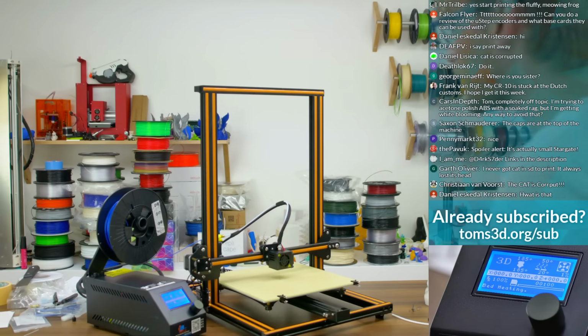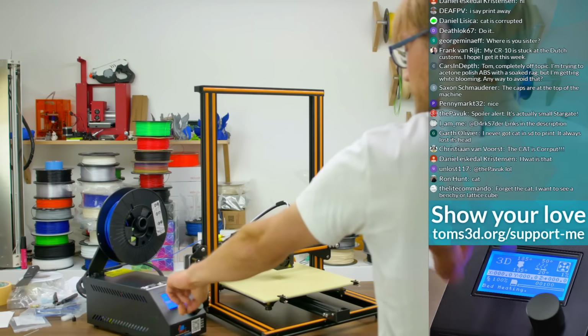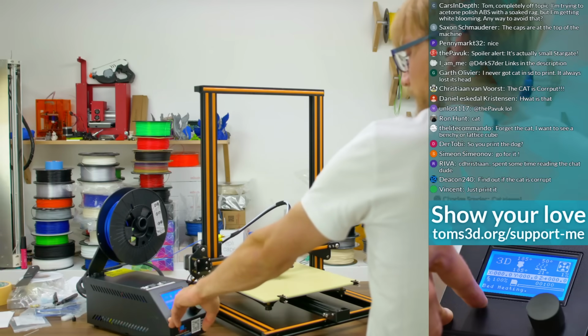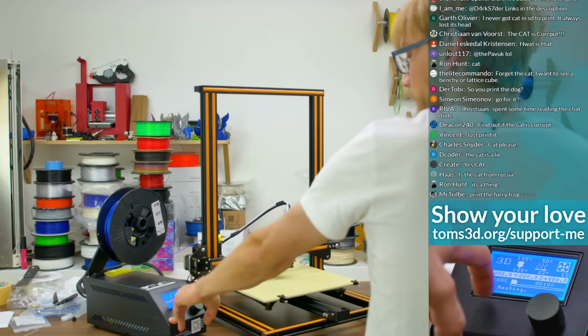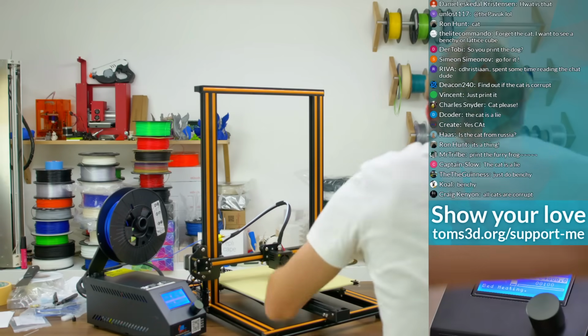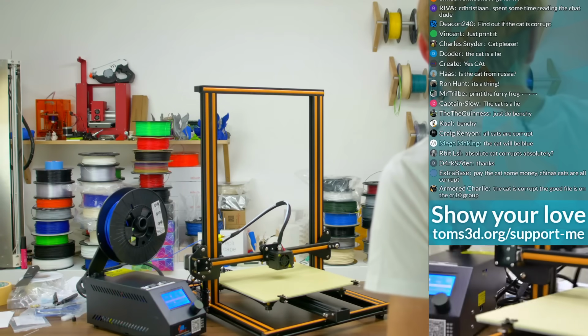Whatever. So it's heating the bed to 50 degrees. It's at 20 right now. Fan is at 1%. That is interesting. Or is that 1% progress? That's fan, I think. Feed rate 100. Yeah, progress is here. 185. 185 is actually pretty cool for this PLA, but the hot end temperature might come with an offset since this is actually extruding quite well.